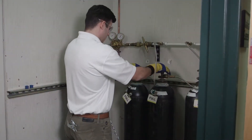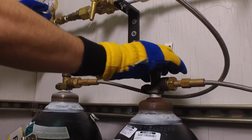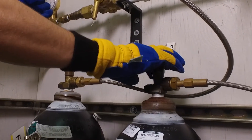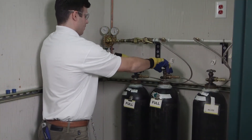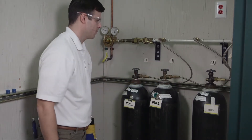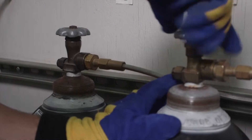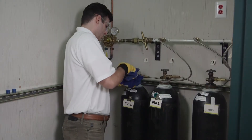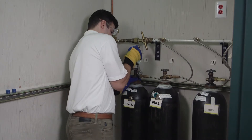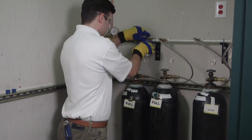Lastly, open the valves on each tank slowly to begin gas flow. You can do this by slowly turning the knob at the top of the cylinder counterclockwise. As you are turning the knob, you should hear a whooshing sound as air exits the cylinder. This noise should disappear and become silent within a few seconds. If a whistling noise remains, turn off the valve, use your adjustable wrench to tighten your connection, and repeat until the whistling silences. Repeat this step with each cylinder in the bank.